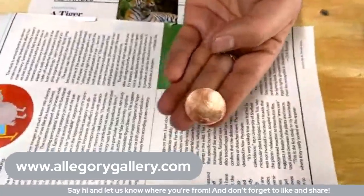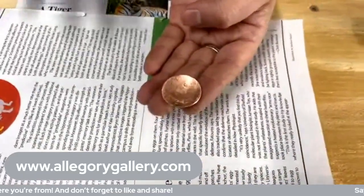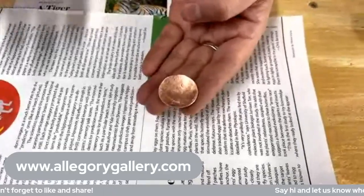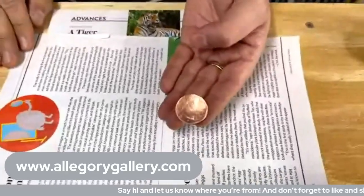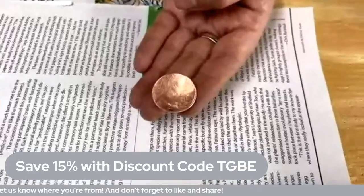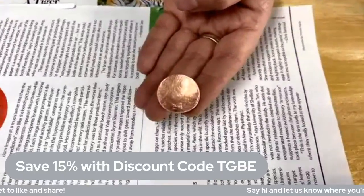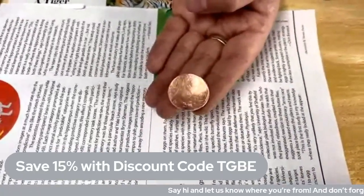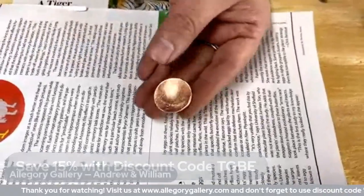Anyway, so we've cleaned this off. One thing is important, whenever you're working with enamel, it's important that you have a super clean surface. If you go eat the popcorn and your fingers are greasy and sticky, go wash your hands. And if you're just naturally greasy, get some gloves out, because otherwise you're going to have some issues. So the first thing we're going to do is make sure that the surface of our metal is super clean.